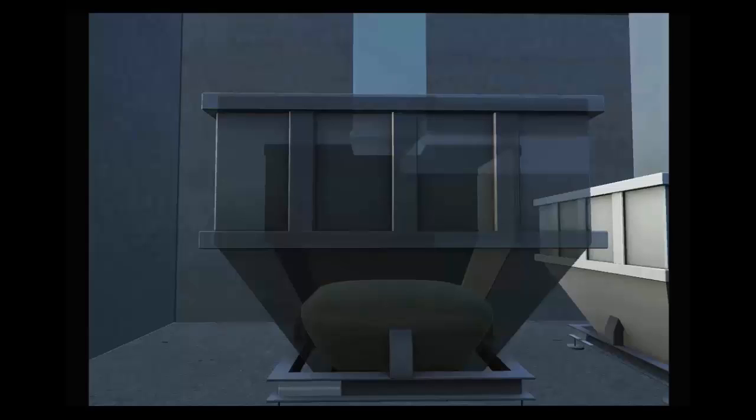Ingredients are weighed one at a time on each scale. However, larger mills may have several scales to weigh up major and minor ingredients simultaneously. Major and minor ingredients are weighed the same way, using major and minor scales and using larger versus smaller quantities. Major ingredients include corn, soybean meal, and their byproducts, whereas minor ingredients include limestone, dicalcium phosphate, and salt.